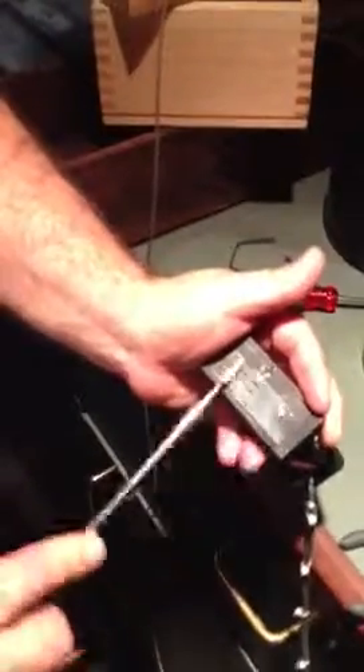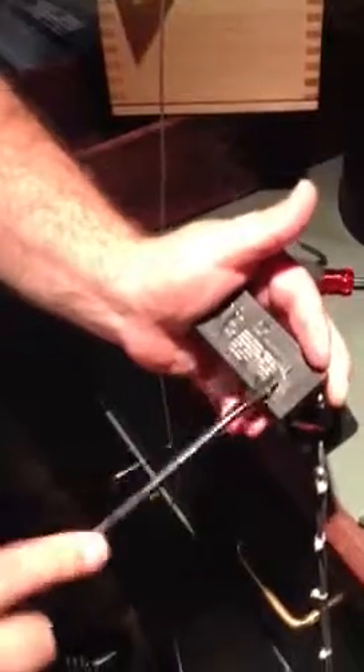The reason the lights are failing is not because the light bulbs or lights are faulty themselves — it's actually this part right here, and you just need to replace it. It's basically a transformer that steps down electricity from 120 to 12 volts, so any replacement would work.